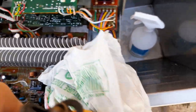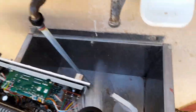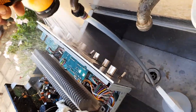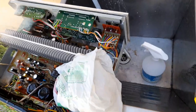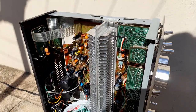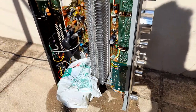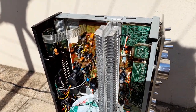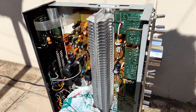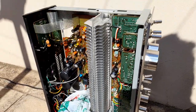I've said this so many times — in big manufacturing facilities they have industrial dishwashers that clean the PCBs. They're especially made for cleaning equipment or PC boards so that it arrives at your place pristine after you've bought it, because the stuff gets dirty in the manufacturing facility. There's all kinds of resins and crap that needs to be washed off. And now it's in the African sun — even though it's the beginning of winter here — just sitting there to drip dry a bit. I'll stick it in the fan oven at about 50 or 60 degrees centigrade to bake off any moisture that might be somewhere underneath a component or absorbed somewhere you don't want it. So I'll just bake it off.